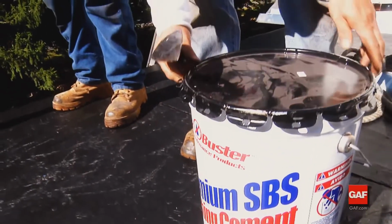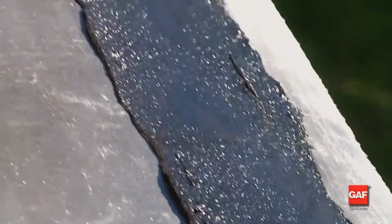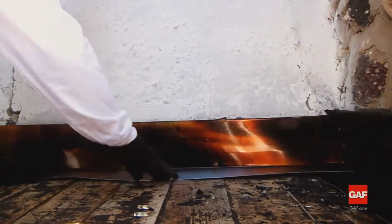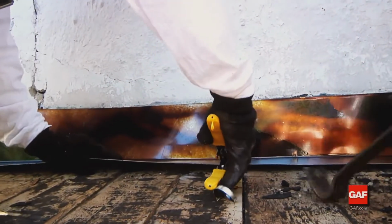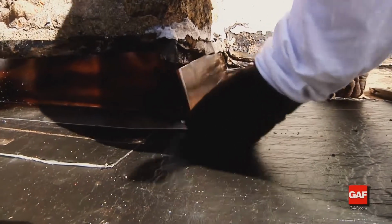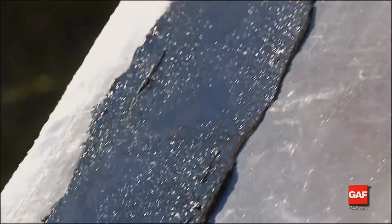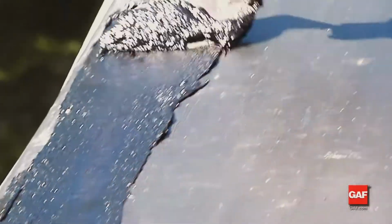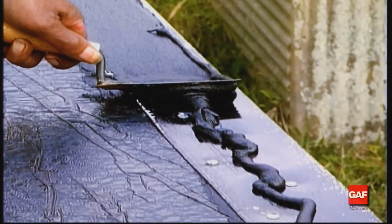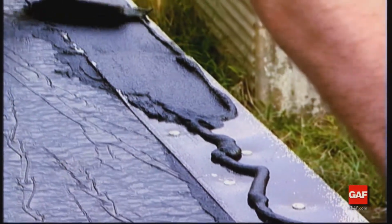Liberty systems require the use of SBS adhesives and cements. Other non-SBS cements may have an adverse reaction and damage the Liberty membrane. Where flanged metal termination and penetration flashings are to be installed, they must be primed and should be installed in a 1/8 to 1/16 inch troweling of Matrix 201 Premium SBS flashing cement over the Liberty base ply sheet. In addition, apply a troweling of Matrix 201 Premium SBS flashing cement to the top of any metal flanges prior to the application of the Liberty cap sheet.